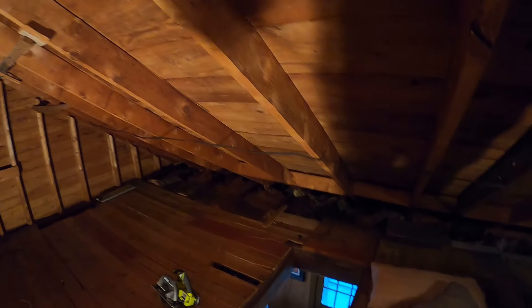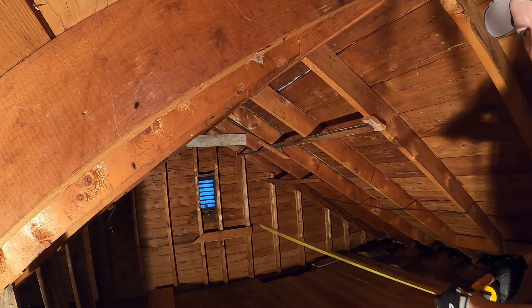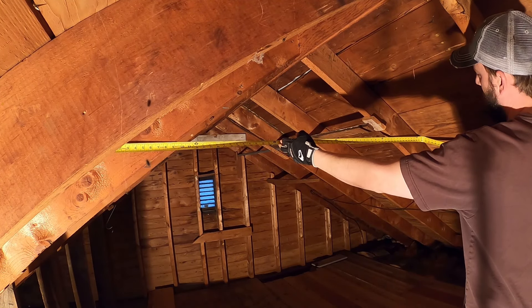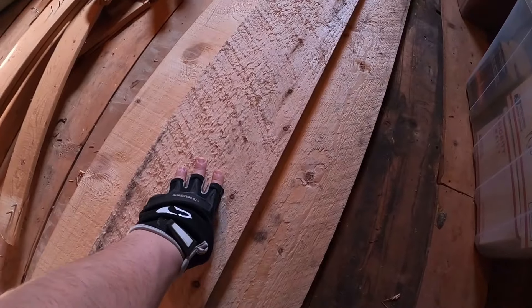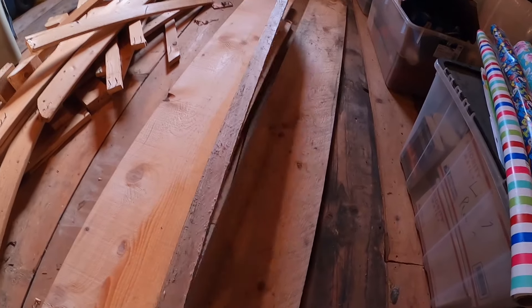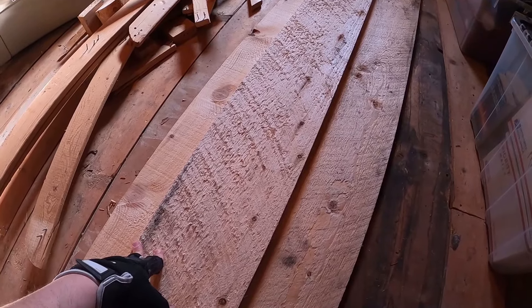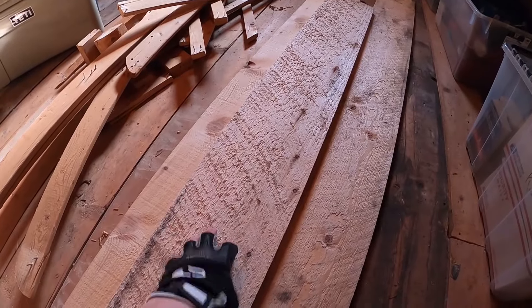You want to be in the upper third of your roof rafters. I've decided to make my collar ties about five feet long, and when you measure five feet here, that will be the long point. These are the boards I'm going to be using for the collar ties — these are one by eight, I got 16-footers. They're called either ledger board, utility board, or spring board — they're called a bunch of different things — but these are actually one inch by eight inch, whereas a lot of lumber is three-quarter by seven and a quarter. This is actually one inch by eight inch, so this is what I'm going to be using.